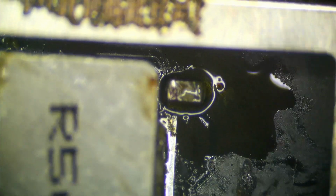Now, we're going to do our same test here. We're going to look at the end caps. This one concerns me here, because the fact that it's near a coil could also mean it's like a bootstrap capacitor or something for a MOSFET, and those we can't remove.